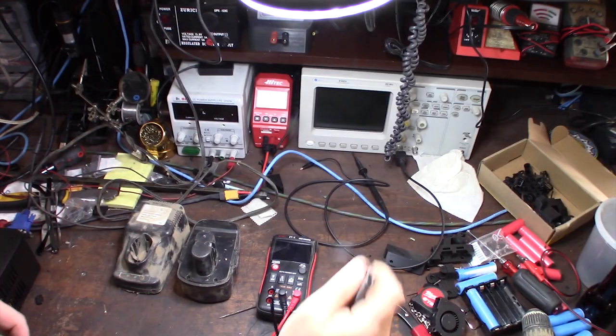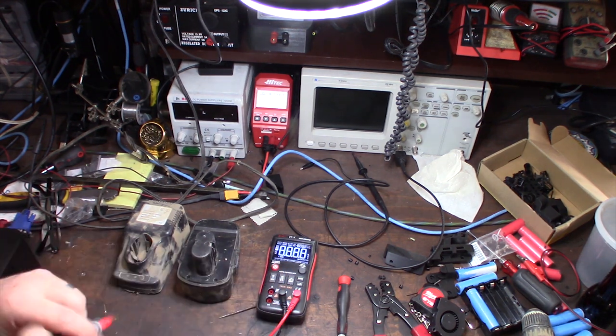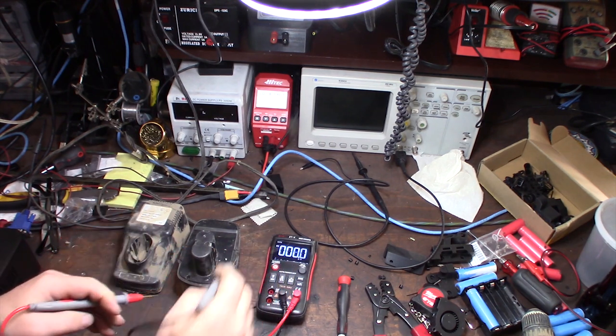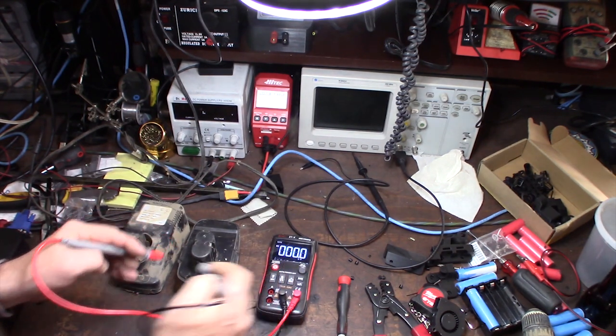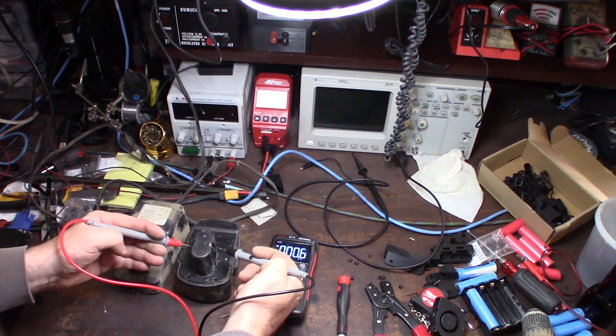Alright, so now I have the battery shock. I don't expect to gain very much on here, but okay, so it's originally 1.1 volt, now it's 3.7 volt. Just by that little shocking. But that's not the point of that. I'm not trying to charge the battery. I'm just trying to break up the dendrite crystals in the NiCad cells.